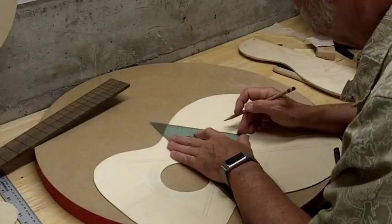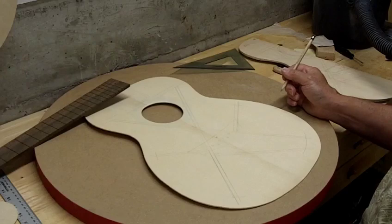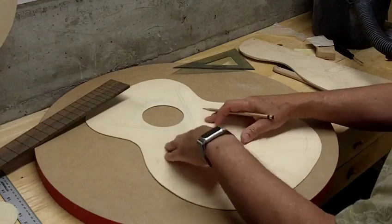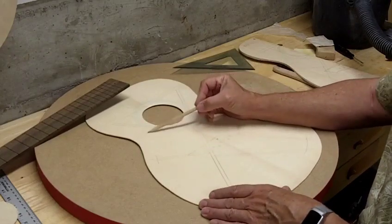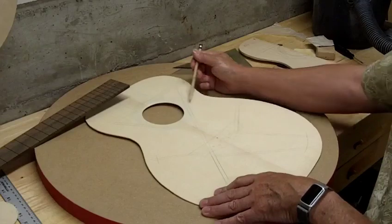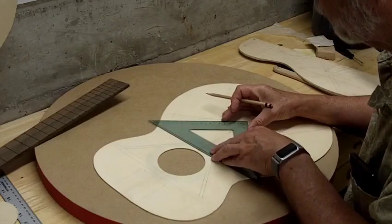So we can look here — somewhere close to a quarter inch, six millimeters in from this. That may be all there is. The question is whether there's any need or reason to stiffen any more here. What we're going to be looking at for a cladding pattern is something that goes around here, intercepts the sound hole right in this area, and just goes all the way around. We'll go ahead and put some sound hole bracing here.